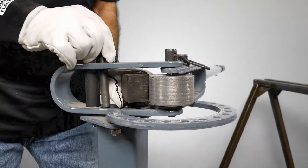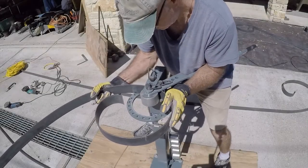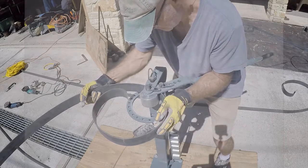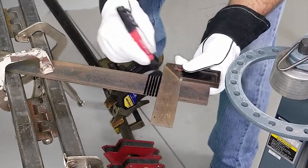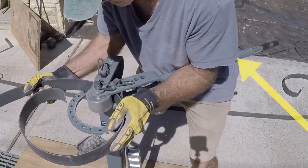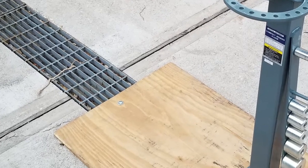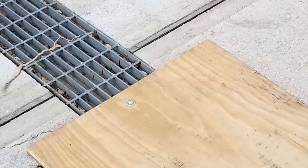Here's a pro tip: use multiple taps with the handle die in succession and close together to form arcs — this is actually how professional fabrication shops use CNC-controlled press brakes to make radius bends in flat sheets of metal. If the multiple taps are close enough, you can barely see that they are actually multiple straight-line bends forming the arc. Also, use your hip and body weight as leverage to push the handle — this frees up your hands to move the material. Finally, bolt the metal bender to a three-quarter-inch piece of plywood and weight or clamp it down.